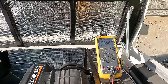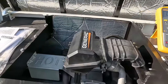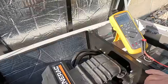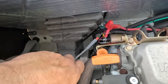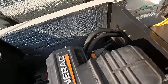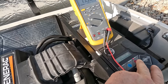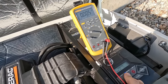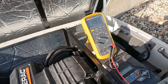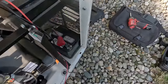Let's go ahead and hook on to our negative on the battery — or we can hook on to the ground of the motor. Let's get down here to the start solenoid. We have 12 volts coming to this right here — that right there should be 12 volts. We have 13.94. Go ahead and hit enter, hit auto. Voltage dropped down to nothing. That's not good. We didn't have that problem when we were on the other one. Let's keep in mind I went to the center post.